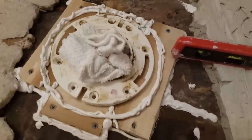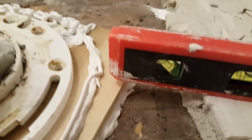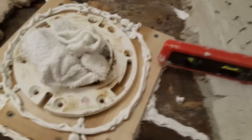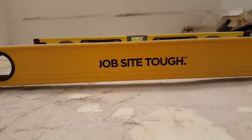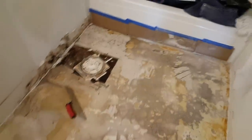You can see we've added our caulking and built a dam around the toilet flange. I'll let this dry so I can pile up more and make it taller, because it needs to be higher to keep the self-leveling cement out. Placing my six-foot level across the bathroom, you can see the gap underneath — in some areas it will fill about half an inch, in other areas about a quarter inch, and it will all be perfectly flat by the end of today.